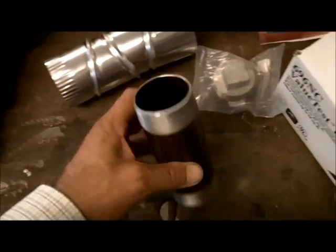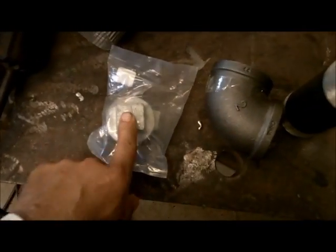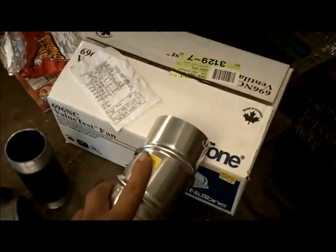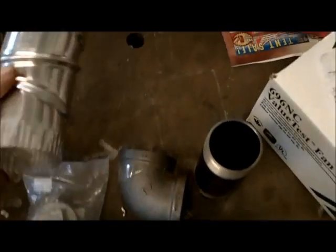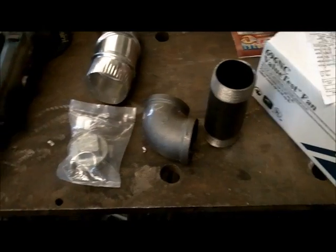Let's go over what I've picked up. These are 2-inch pipes, a 2-inch cap, and a 2-inch elbow — but the cap is galvanized. I know we've had this talk before, but if it's outdoors, which this forge would be anyway, this is only a small amount of galvanizing and it's going to burn off really fast inside the bottom of the forge. The cap is going to be your final piece — we're going to drill it out. You also need something 3-inch to go from the fan to the pipe. This was the only thing they had — it's aluminum, which is not really ideal, but it shouldn't get that hot under there anyway because the fan has a plastic flange.